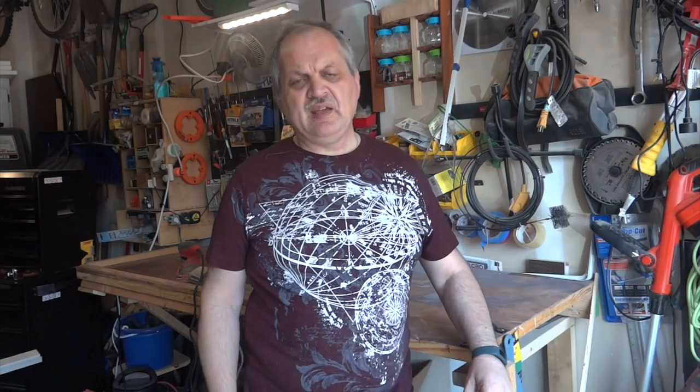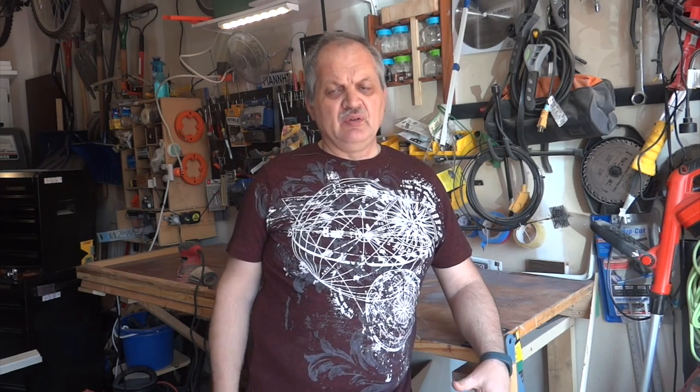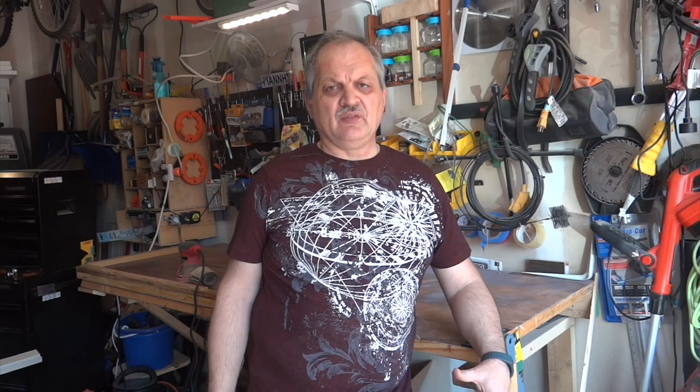A tip if you're a beginner woodworker and you don't have a lot of tools is to actually buy boards that are already cut to at least one of the 2 dimensions you need. In my last few videos I've used lath wood and I've used 2x2s. 2x2s make great legs for small furniture. They are already cut for you, so you only have to cut them in length. They are fairly inexpensive, and they don't require you to have a lot of expensive equipment.